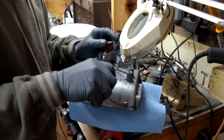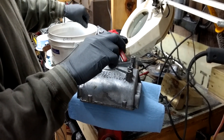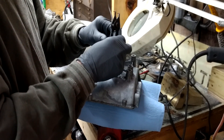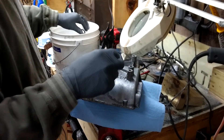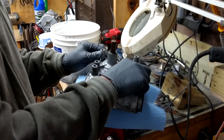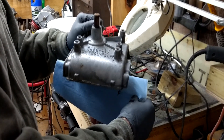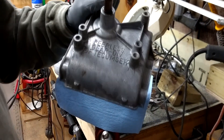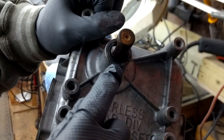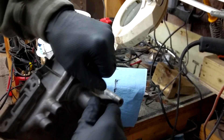Now I need a pair of snap ring pliers. I get that snap ring — comes right off just like that. I'll drop that in my parts cleaner bin. Then off comes the thrust washer, and now you'll see it better when I pull the gear out, but you can see right here there is a seal in there. Let me push this puppy right out of there and take it right out the top side. Woohoo — look at that, just like that!